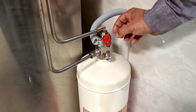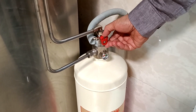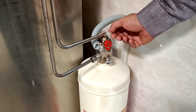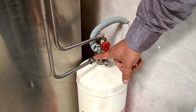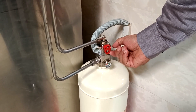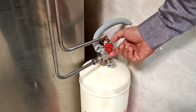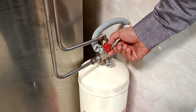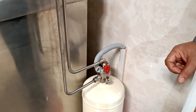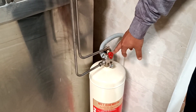On the ILP valve, you also have an integrated ball valve. This is the lever to operate that ball valve. This ball valve is very essential in the operation of the system — if left closed, even if the system activates, it will not allow any output from any of the ports. The valve is always kept in its open position; if it is at 90 degrees, then it is a closed valve. There are provisions to monitor the open and closed position of the valve by a reed switch. This reed switch is a magnetized switch which, without any intrusion into the valve body, can detect the position of the valve.